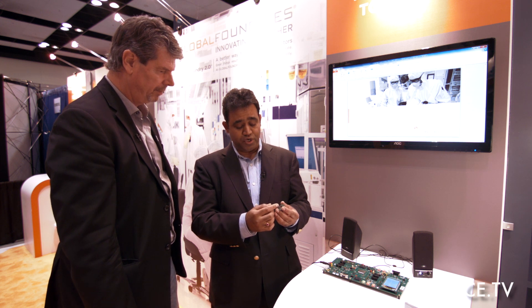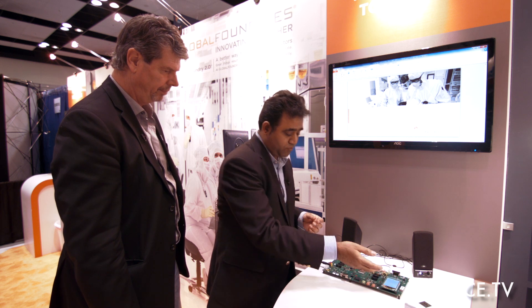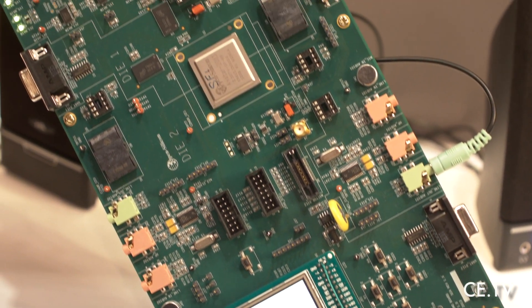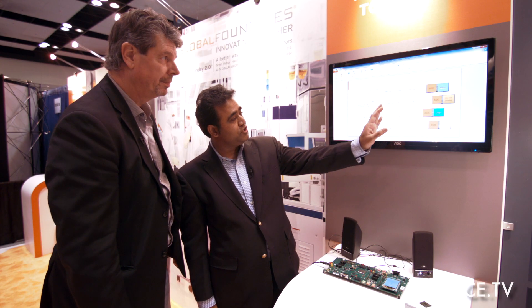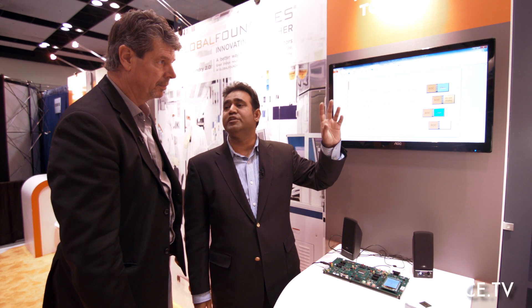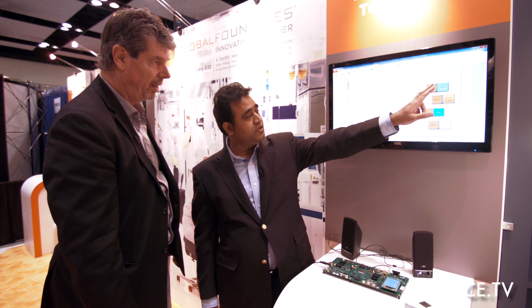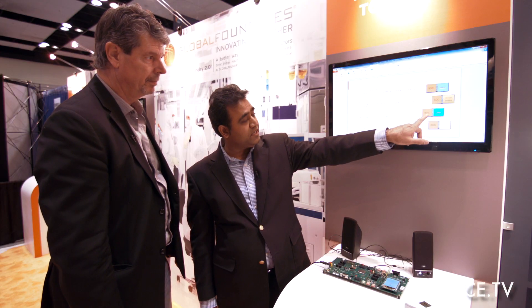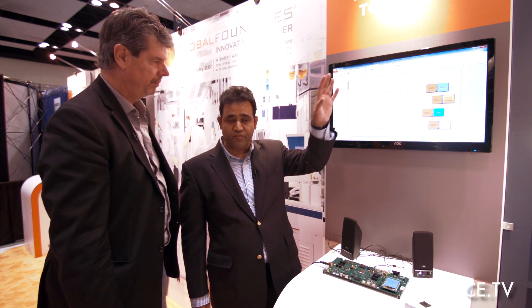What you're seeing here — let me go to the next slide and try to show you the value proposition. In a silicon interposer, you can pair two dies or maybe multiple dies on an interposer. As you can see here, you have an SOC with a memory — those are two different dies, and those are the connections on the interposer. Here you have an SOC with high-speed analog. This is a different pairing associated with some other logic or an FPGA. You can do multiple permutations and combinations — that's the value proposition here.